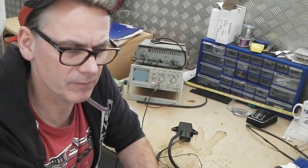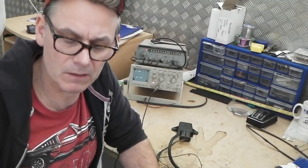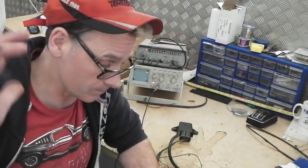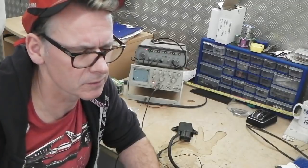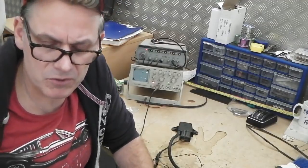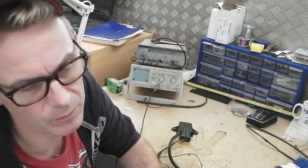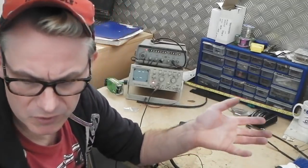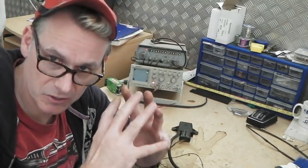If you're going uphill in overdrive and you put your foot down, the engine's now loading, the vac sensor on the engine throttle, the changeover valve at the side of the gearbox will pull in because you're loading the engine, vac decreases, and the armature, the locking pin on the side of the, oh god, I'm cracking up, not the coil, the vacuum modulator was the word, long day. The side of the modulator moves, changes the gear, but if the lockup is still engaged, the gear change will be harsh because you've not got the cushioning effect.